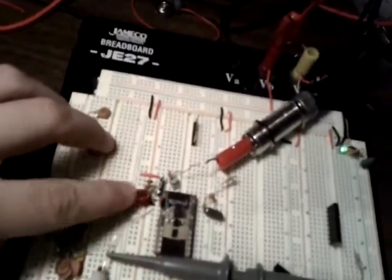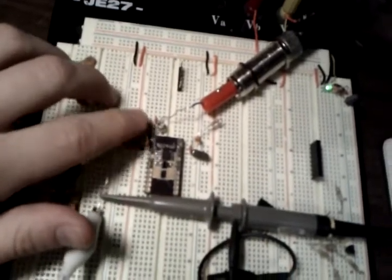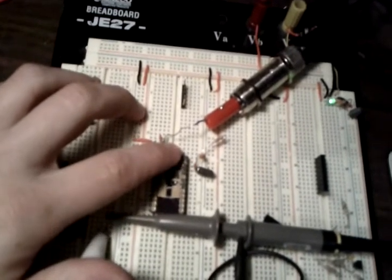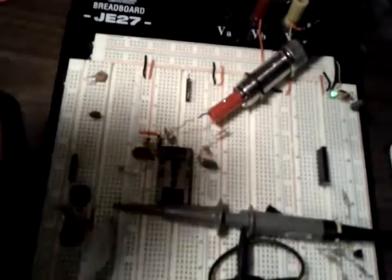The schematic is right here — you can't really see it. It just has a 10 MHz tuned input and a standard crystal oscillator using 40 picofarad caps. For the front end, I had a 1.4 microhenry toroid from failed experiments lying around, so I used that and calculated the capacitance needed. I've got some 9-to-50 picofarad trim caps lying around, so I used one of those. Even though it's kind of messy, it seems to work okay.